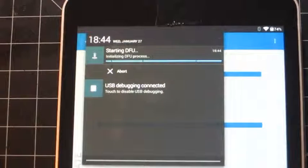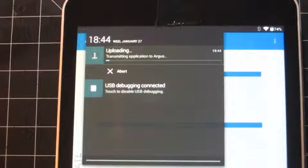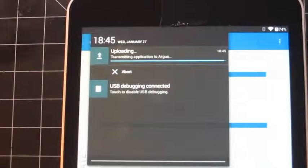On a final note of interest, to date I've managed to keep the code size just under the limit to be able to do DFU transfers of the firmware. This means that in order to update the hardware's code, you only need a BLE-capable mobile device. No wires, no programmers, just a file in a few minutes.